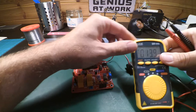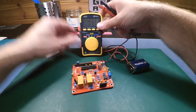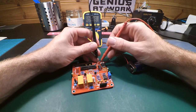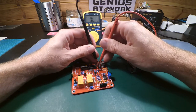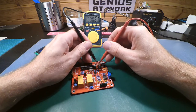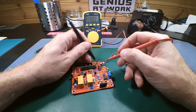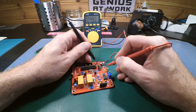Step one done. Let me check the meter. We have ground and we have positive. We measure 9.05V — good. Let's check the 7805: we have 9.05V on the input and 5V on the output. The board is not getting warm or anything, so there shouldn't be any short circuits.